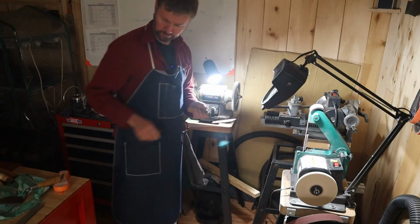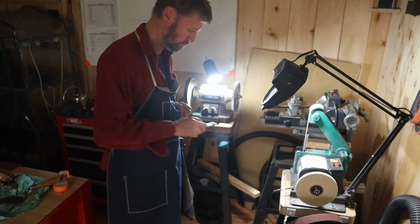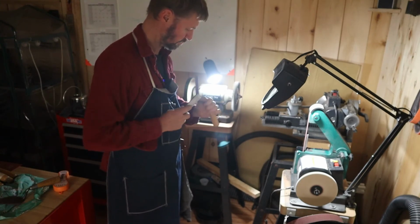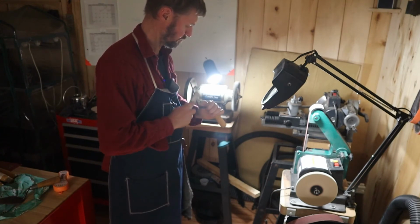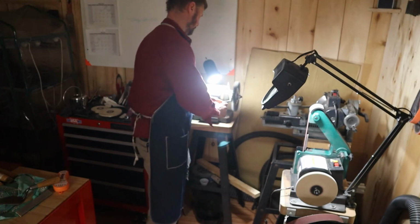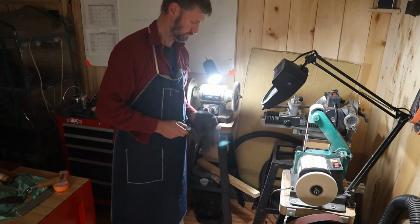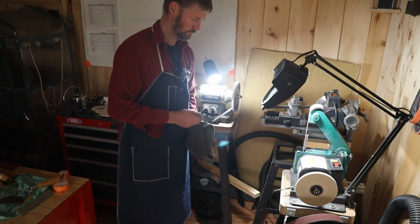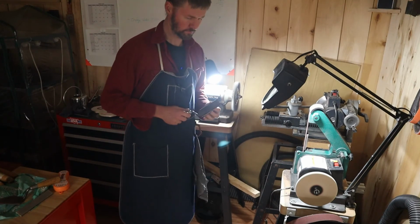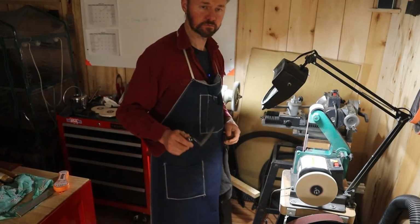And then what I did is I grabbed my 220 grit stone for my Edge Pro, and on the bevel, I'm just cutting that burr off. Cutting the burr off. It's not super clean because it's a pretty coarse cut at the moment. But then just to finish it, I probably put a little burr onto the flat side, so I'm going to push that burr back into the bevel. And then using my rag here, not cutting my fingers, I'm pulling off any of those little burr flakes and check it. It has an edge, good to go.